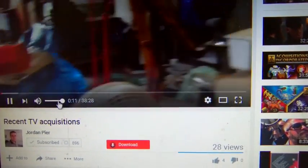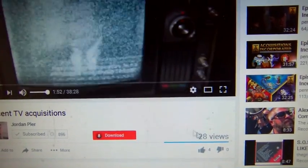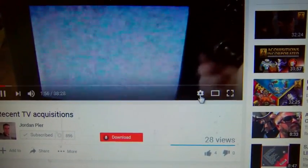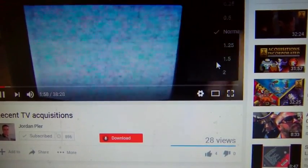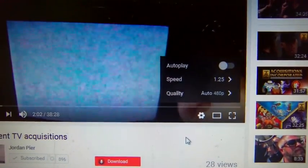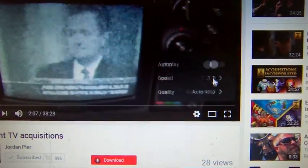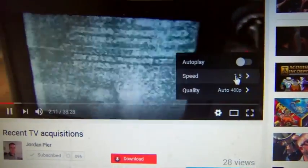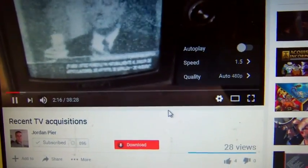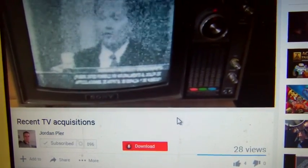...kind of plucking out what we're wanting to salvage and what we're not. So I got a bunch of picture but no sound. There are still a couple of stations in Tijuana that broadcast an analog signal. It's got a big grayscale, it's just not very bright and it's kind of blurry. The picture's very crooked, so at least it shows signs of life. Next thing to do is get the CRT tester on it and see what the guns look like.